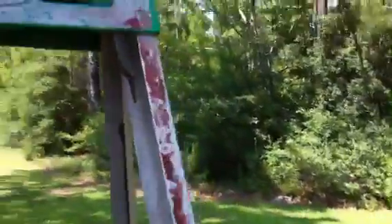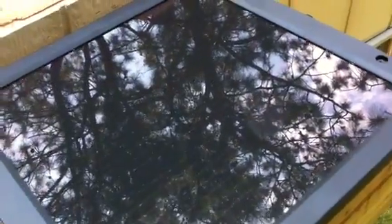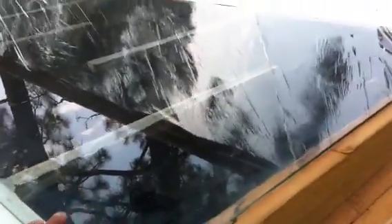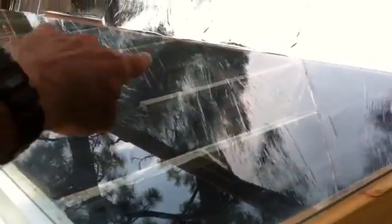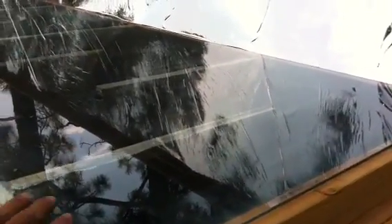On this end, we have a solar voltaic panel that powers — or keeps charged — a battery to power the fan that forces air through this solar heater. The air comes in up through here and snakes its way through the baffles of this metal roofing that has been painted with high temperature black paint.